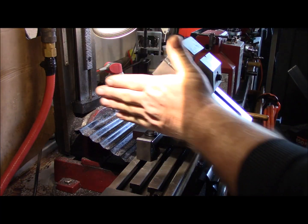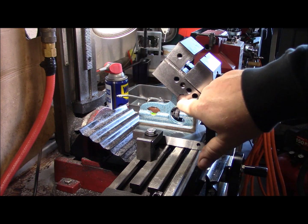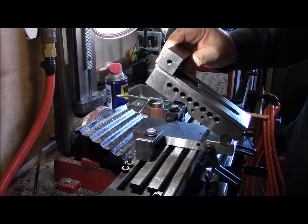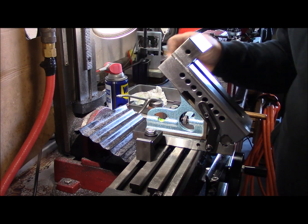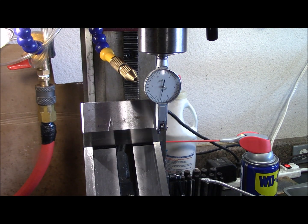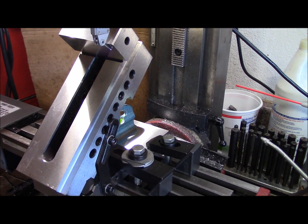I have it aligned this way. Now I need to put a carpenter's square underneath it to check my 45-degree angle, but this bar is in the way so I have to pull it out. I don't need the bar in this particular application so I'll go ahead and leave it off. Somehow I got a couple thou of creep in there, so I've added a third clamp to reach inside the center and bring that front end in. I'm still a couple thou off on the surface here, so I'll loosen up the left side and tap it in where it needs to be.